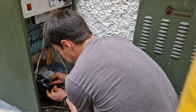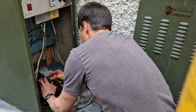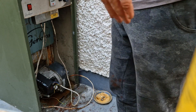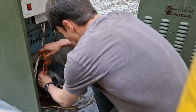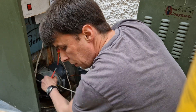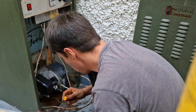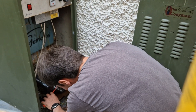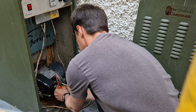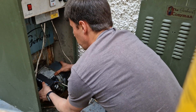Brown is live, blue is neutral. Close that back up. I want to ensure that the ground is also connected somewhere, just to make sure that everybody's on the same zero potential. That's the power in. We have the grounding, which also connects to the chassis.